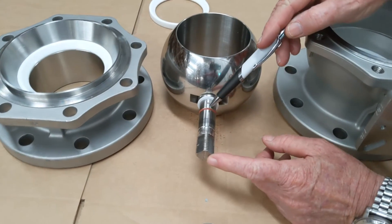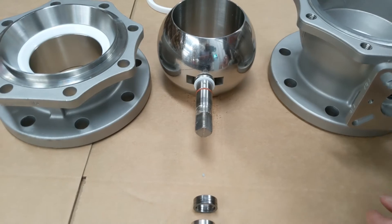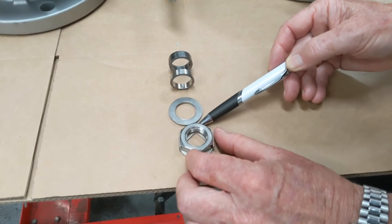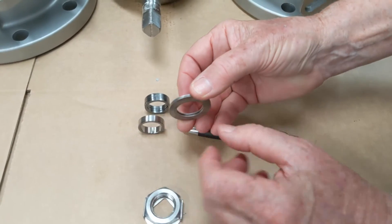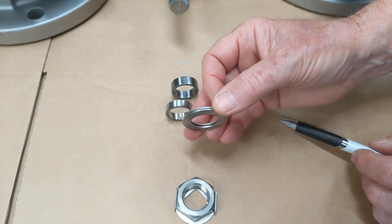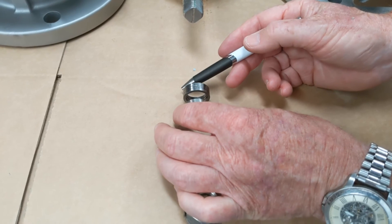The Viton seal is a backup for a bubble-tight seal below the graphite chevron seals. Going down the assembly, there is a nut at the very top with a locking face, then a set of Belville washers — slightly conical washers — which get compressed down to give a live loaded packing. This provides a consistent thrust on the thrust washer, unlike a gland which has variable thrust.